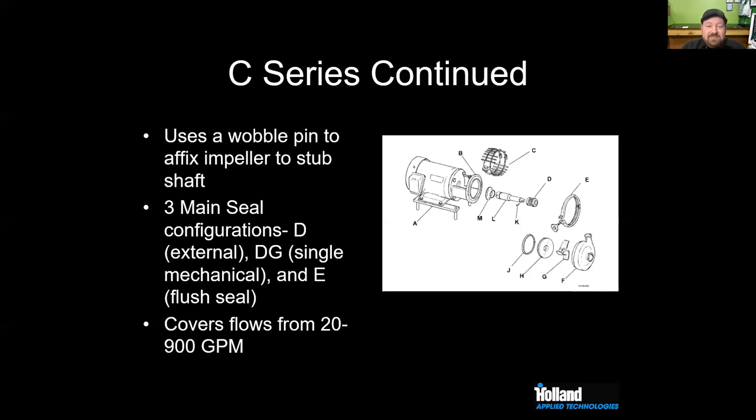You know, I've wondered that a really long time. You used to call me and say, oh, the impeller pin fell out. And I'm like, well, how the heck did that happen, right? But that's what it is then. They don't set the drive collar right. They change their seal, and that causes the impeller to shift back just a little on the shaft, or forward. That's a tiny pin, and you don't have nice tension on it, right? And the pin will drop right out. That explains it. See, you and I learned something in this webinar. That's interesting.